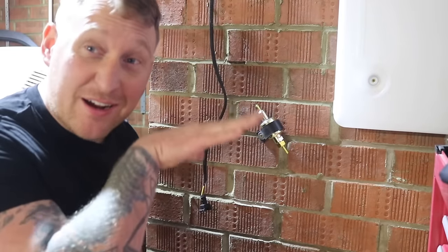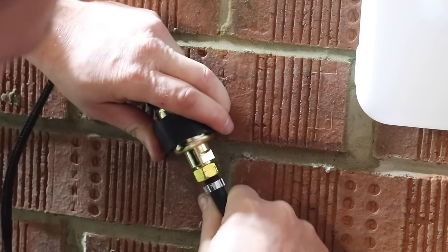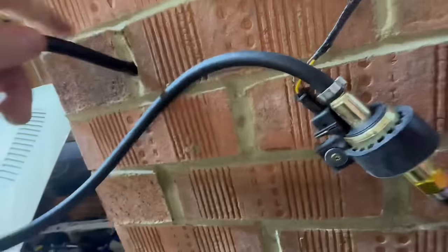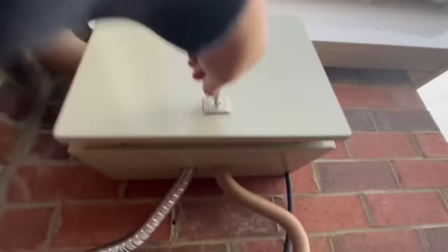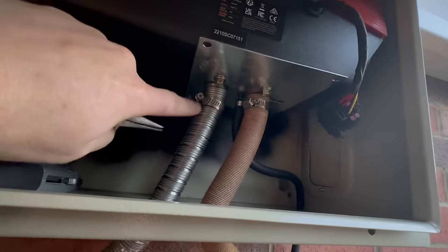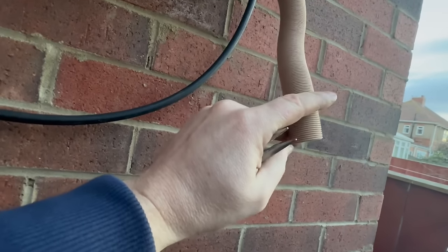This pump needs to be set at an angle of about 45 degrees, which is exactly in the middle between 0 and 90 degrees. This is a new replacement fuel line with a 5mm bore — I'll leave a link to the exact fuel line in the description. So as you can see we've got the box mounted, the heater in, the fuel line going in, the combustion inlet, the combustion outlet, the outlet for the heat that goes into the garage, and the inlet for the return air. We've also got the exhaust mounted and the fuel line coming through the wall into the box. I'm going to put a filter on the end of here just to stop bugs and that from getting in.